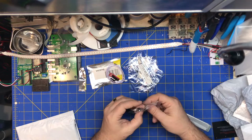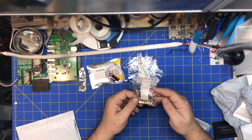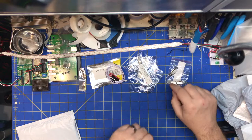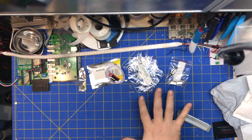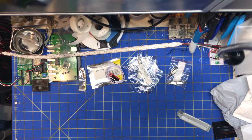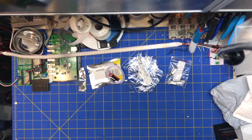These are bed clips for a glass bed 3D printer. I don't know if they're gonna fit mine, but they were the cheapest ones you can get. A lot of people recommend Swiss clips — they're for mirrors and frames — very expensive, like $8 a pop. These were like $5 for four. Right now my glass is just sitting on the bed. Luckily it doesn't move much because I still have the magnetic surface on it, so it's kind of rubbery. Once you put clips on and start pinching corners, you can actually get more problems.